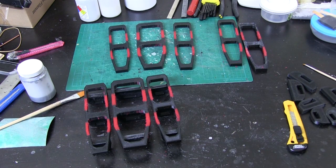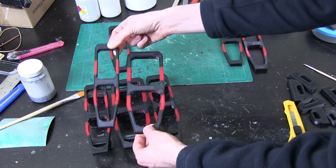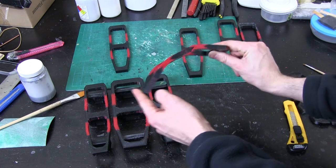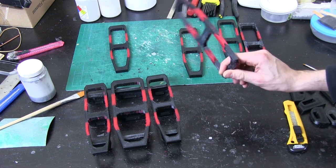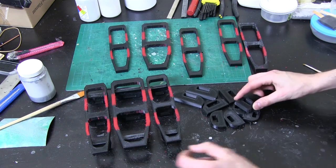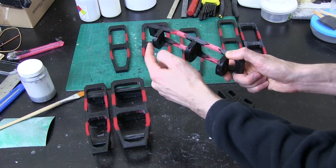After about two days of printing, I've got enough parts here for both hands — the wider middle finger and smaller ones for each side and the thumb. The joints are quite bendy; the black parts are rigid ABS and the red parts are flexible rubber. It bends only at the joints, which will make quite a good finger. I've also got the little pieces that hold a roller or let the tendon pull through attached to each section. So we can pull a cord through there to bend each finger.